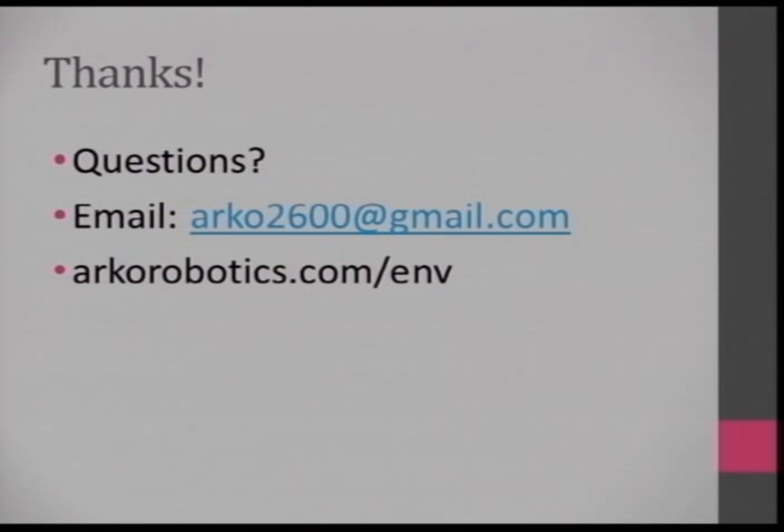And I think that's it. I hope I didn't run through this too quickly. My extended edition with everything you'd ever want to know is on the site, including information on EMC. Questions? — With conformal coating, it's a one-way trip, isn't it? It is — that's the problem. You should conformal coat once you've debugged everything. There are techniques like putting tape over connectors to prevent coating over important stuff, but if there's a major problem — like needing to run a wire you forgot — trying to get that stuff off is a big pain.